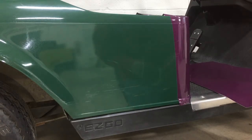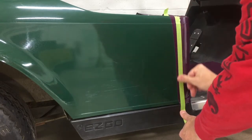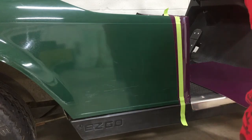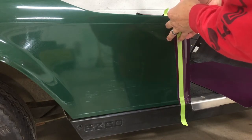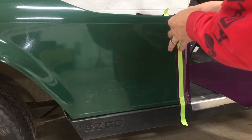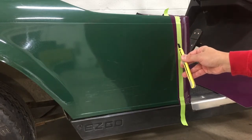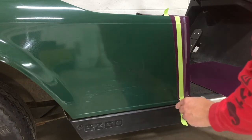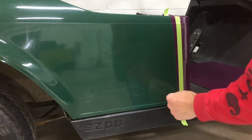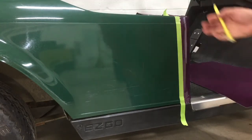One of the things you can do to keep your installation nice and tidy is cut yourself a new straight line. If you use masking tape as your guide, you can run your blade right along that to give yourself a nice straight overlap. Using your snap blade knife, cut yourself a new straight line, using the masking tape as your straight edge — this is pretty much just to keep your install nice and pretty. Once you have it cut, pull it up and that will take up any wrinkles or imperfections that you got as you went around the corner.